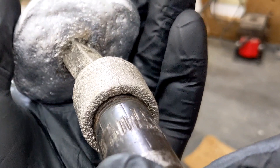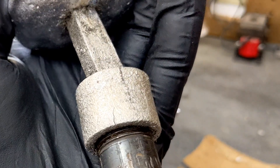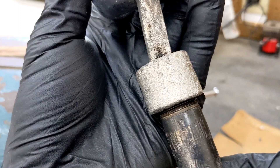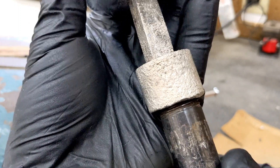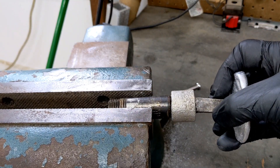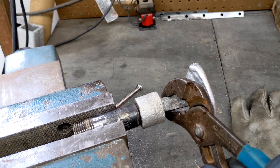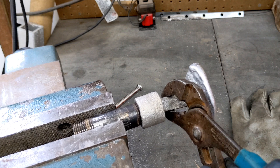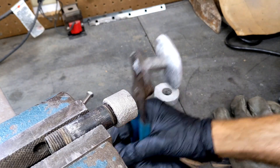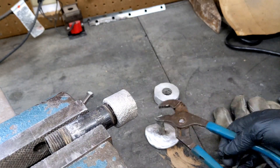Now, I did notice there was a crack in the aluminum. I'm not sure if putting it under the water caused it, but it's there. So maybe next time if I wanted to make threads, I would make the foam a little bit thicker. So now let's bring it to the vise and try to unthread it. And again, at the beginning it really took a grip to the pipe. And you can see here, even though it's threaded, it still really gripped the pipe — I just tore the aluminum right off of it.